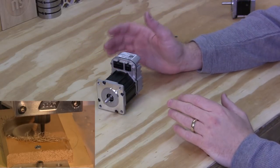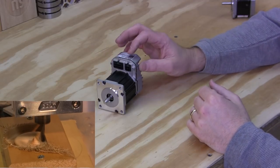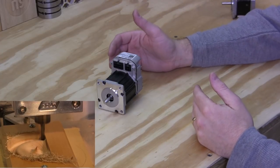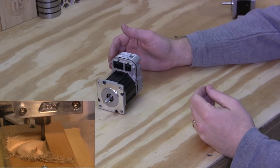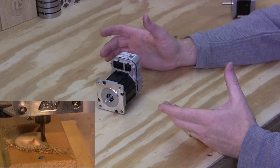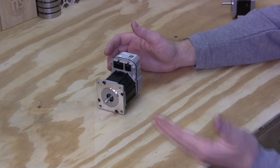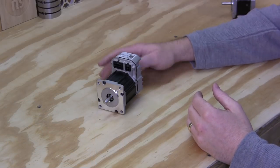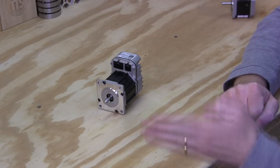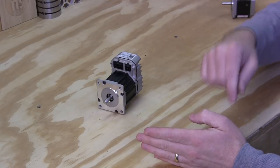So if you saw the 3D cutting job that I did recently, and I'll put a link below in case you haven't seen that particular video, I had my three-axis mini CNC machine running, and it was the first time I'd cut a 3D contour part. It wasn't a very big part. It was only about 3 inches in diameter and maybe a half inch deep, using a quarter inch end mill. And that job, I was only taking 10/1000ths of a step over every time it was making a linear pass.